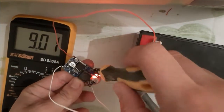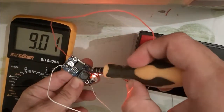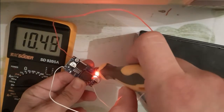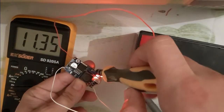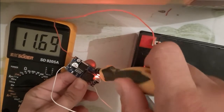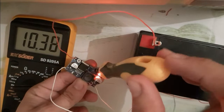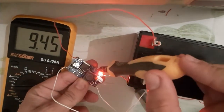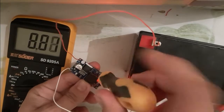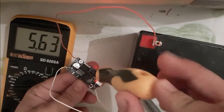If I want 10, let me continue turning. If I want 11 and continue, the voltage has been increased. But if I reach 12 volts — the same as the battery input — it will not work beyond that. It works only to drop, to decrease the voltage, not to increase it. For example, if I want 5 volts, I can do that.